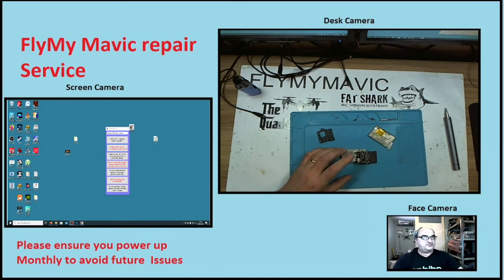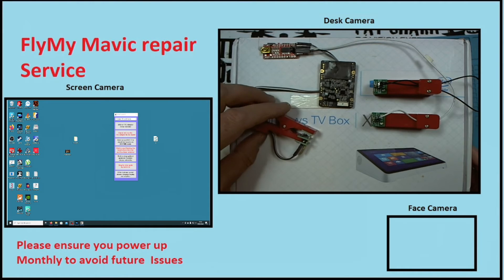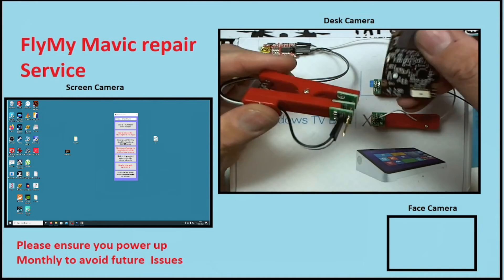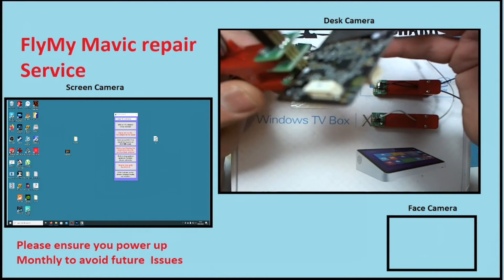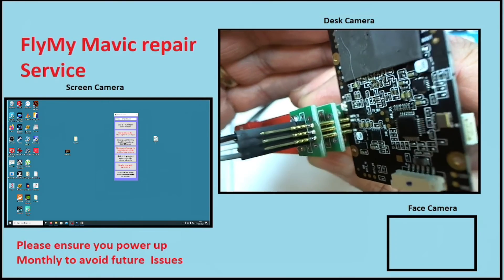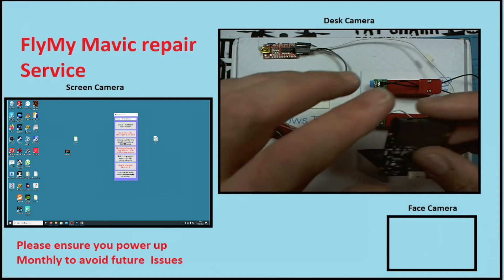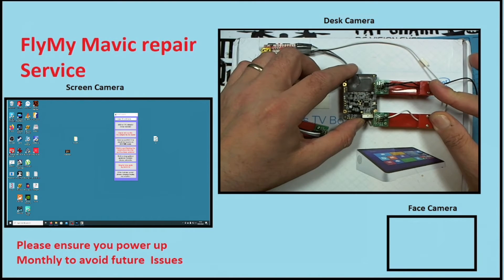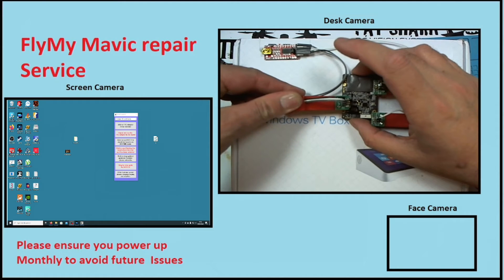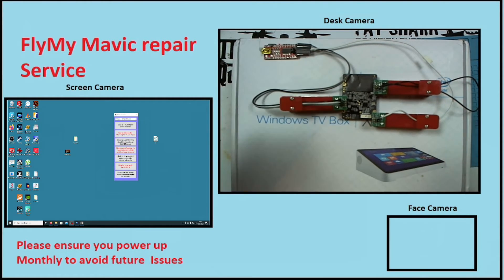This is the non-solder technique — I wish I'd found this five or six years ago; it would have saved me so much time. These are pogo pin clamps. As you can see, you open them up and they've got spring-loaded pogo pins that fix onto the test points on the board and hold it in place. You use the two-millimetre gap ones with DuPont cables attached. I'm using double-sided tape to hold the clamps in place. All I need to do is open these up, pop one onto the two points here, make sure that hits the five-volt point, bring this one in, and clamp it on. That's now all ready to flash.